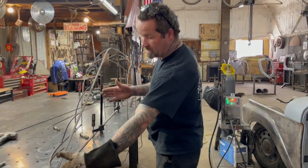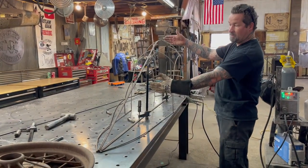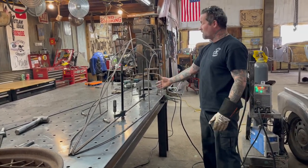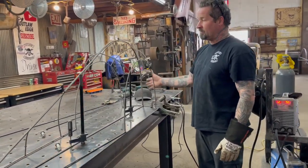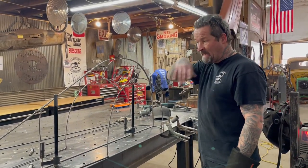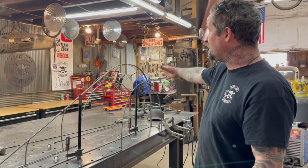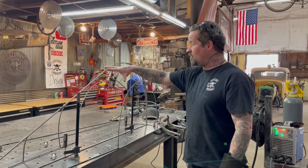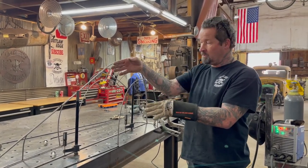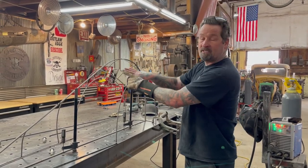A lot of times I'll mark these where they're at, maybe cut them out, make the exact same piece, and put them in there. Get them welded in so they're nice and uniform. When you're shaping the metal to go onto this buck, you have somewhere to weld to. Do those as stations — you can do this piece here, then from here to here. You can do that piece, and then from here to here. This is going to be your most difficult piece. In the next couple of videos you'll see us starting to form some of the sheet metal on this and how to get a nice clean transition with the metal.